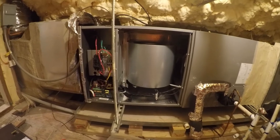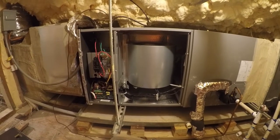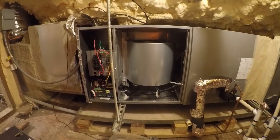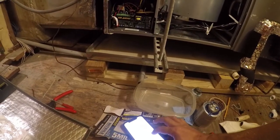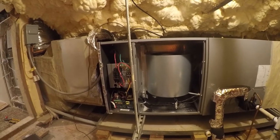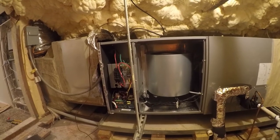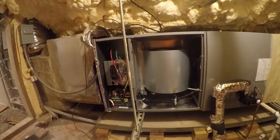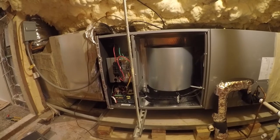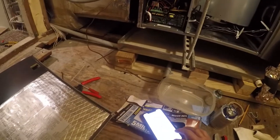So let's see if the fan comes on at this point, because the system's calling for fan. I just don't know what the hell's going on. It's ignoring the 24 volt thermostat. They put this in cool. 74. You know, I get that the outdoor unit has a time delay on it, but the indoor unit shouldn't. The fan should come on and off on command. If it's really truly going to respond to 24 volts, it should respond. And it's just flat out ignoring me.